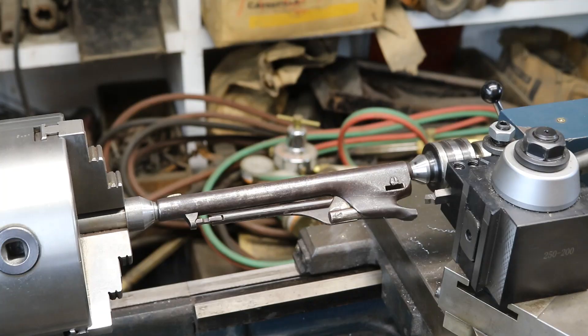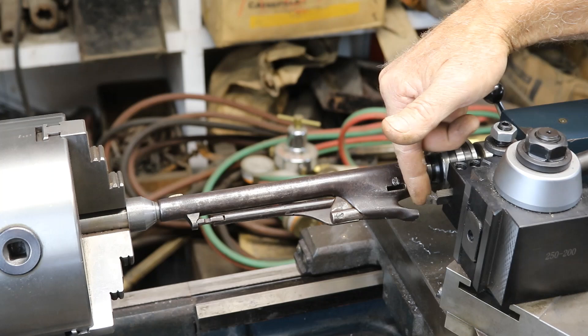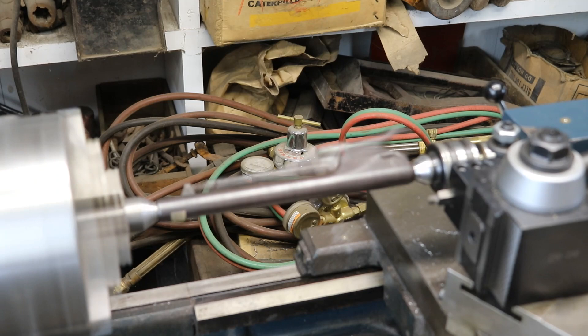If you're curious about what I meant by turning between centers on the lathe, this is the setup and this is how we did it on the other barrel. We put the barrel in between two centers so it turns right on the center line of the bore. Then we take our bit and just trim the face back, adjusting by the scales on our dials to control exactly how far we go. We adjust the bit back and forth until we get the desired dimension we're after.